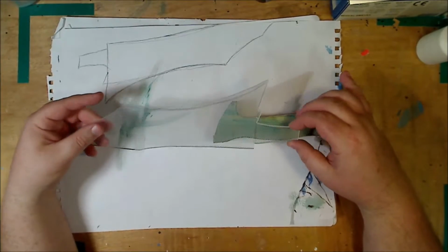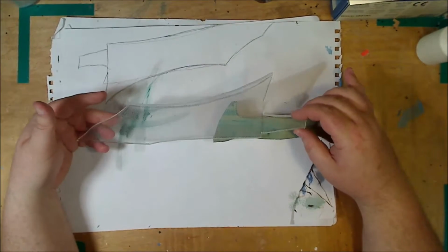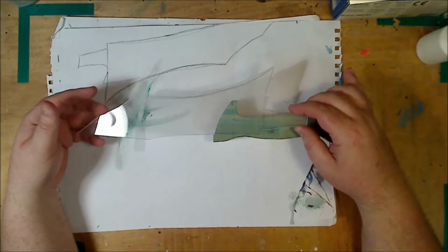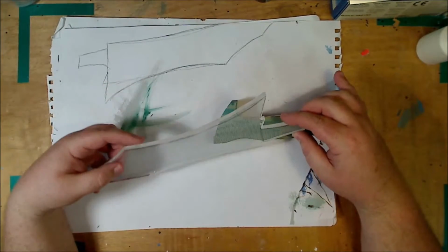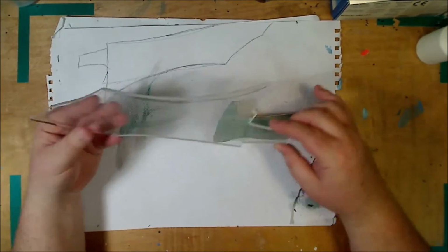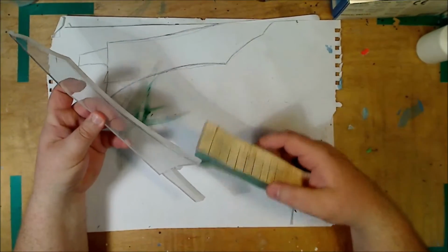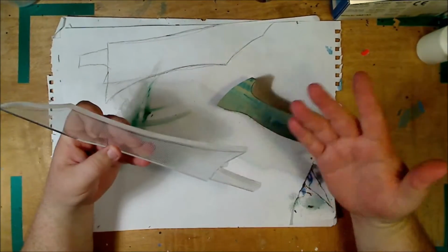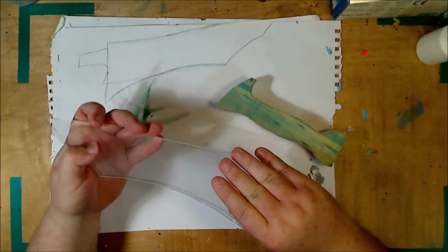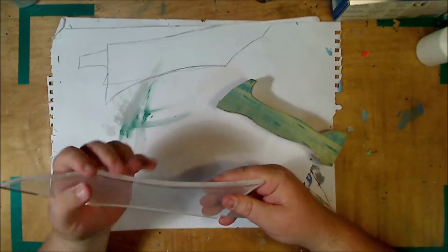You'd have to take it slow and be a bit careful, but it cut perfectly fine on my bandsaw, and my bandsaw only has a wood blade on it. There was a bit of jagging and burring along the edge, but to get rid of that, all I had to do was get the timber, scrape it up the edge, along the frame, and it all just came straight off. That'd be a nice, safe edge to work with. I can't cut myself on that.